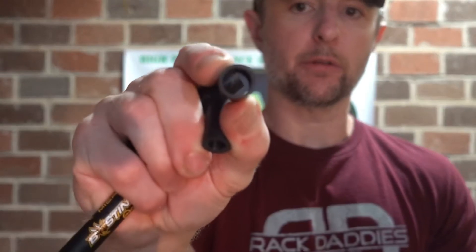The products have been cut apart as you can see. I want to get into the dimensions. The B Stinger's carbon has a very thick wall — about 0.100 inches, or one hundred thousandths of an inch. The outer diameter is approximately half an inch, so it's a very thin outer diameter. Our wall is much thinner. You can see the B Stinger's wall on the cut-off portion, and I also have a small chunk cut to exactly one inch in length from each product.